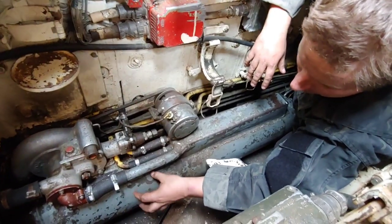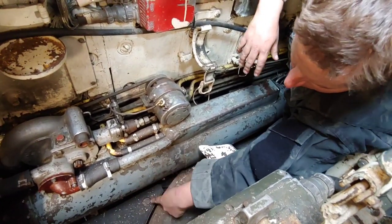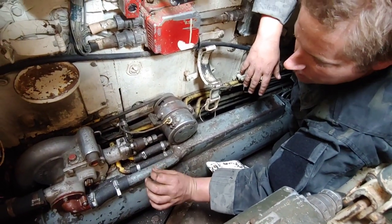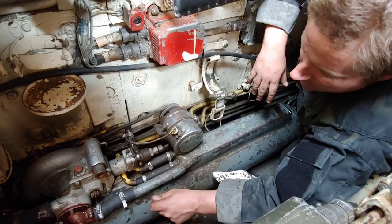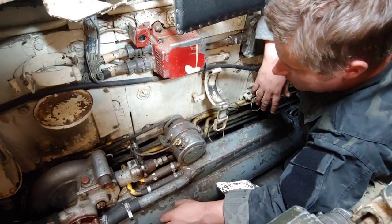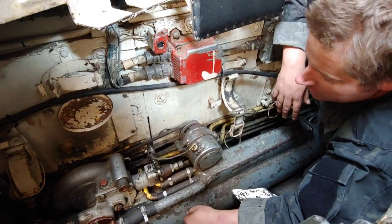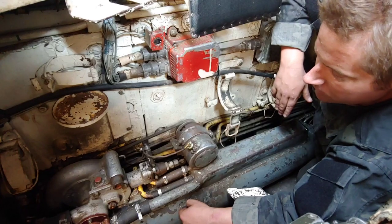Because there's a giant diesel flame burning in here, there is actually an exhaust port that shoots out the bottom of the tank right here. If you don't have quite an accurate adjustment, you can actually see diesel flame shooting up the exhaust port underneath the tank. That's one of the units we won't be using here in Las Vegas without the cold, but it is a unique feature of these tanks — a really cool way of preheating.